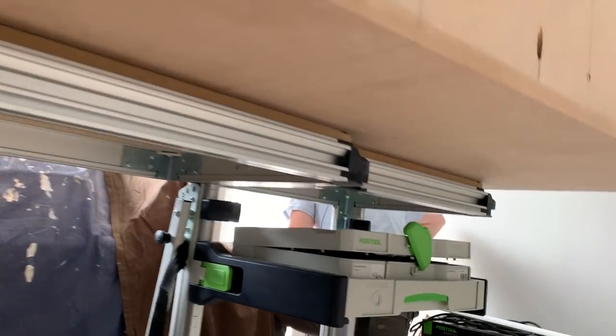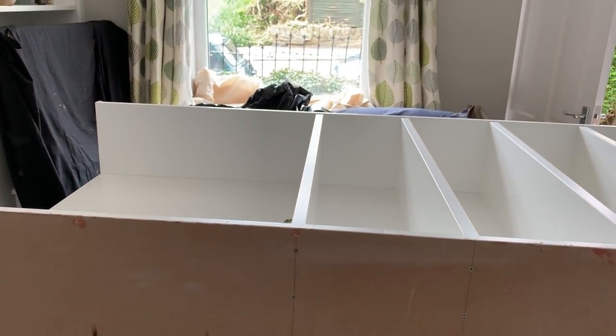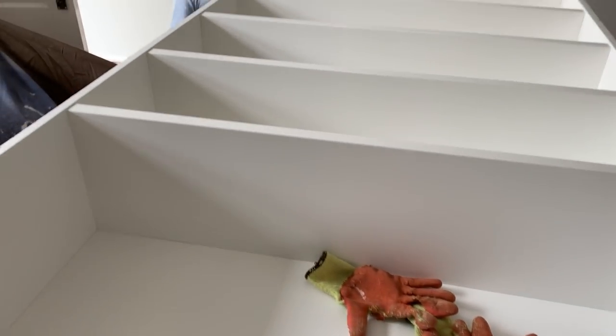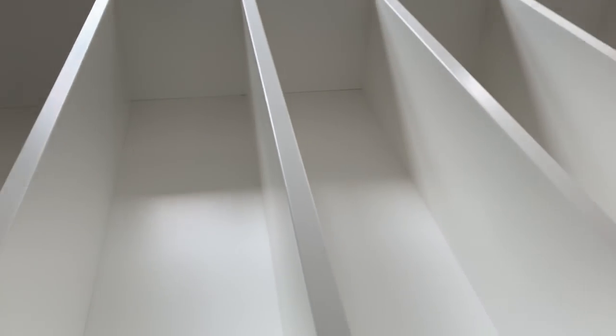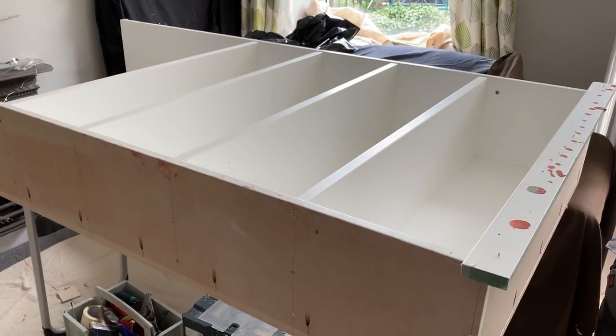It also allows us to put screws through the back. That's the one thing we do after the whole thing's assembled — we turn it onto its side, square lines down the back down the centre of the shelf, and by having that substantial back panel we can weight-bear at the midpoint of the shelves. So we would never fit MDF shelves fixed only at the ends — we would always fix through the back panel because you've got confidence then that they won't sag. Also the shelves are 25mm, so we'd quite rarely use 18mm for the shelves — it's usually 25 or 22. I've never had a callback for sagging shelves. MDF used correctly is a very suitable material for this type of work. You can see what a finish we get on it — there's very slight orange peel there, it actually looks better in reality than it does close up, but you can see it's a good finish.